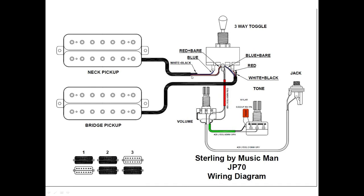You need to remove the pickup wiring for both the neck and the bridge — desolder them. Then at the tone you also need to change it, so desolder both legs of the capacitor, and also the cable coming from the volume. That's it — keep everything else as it is.